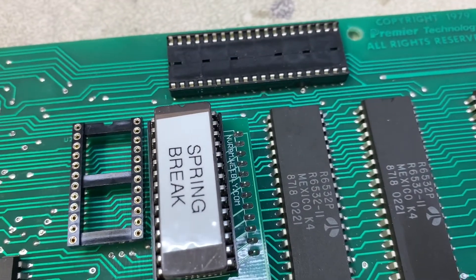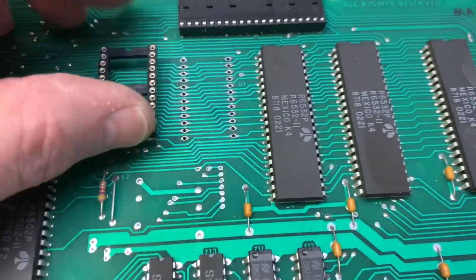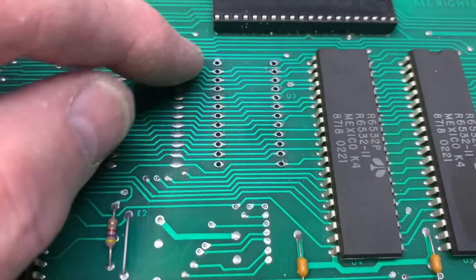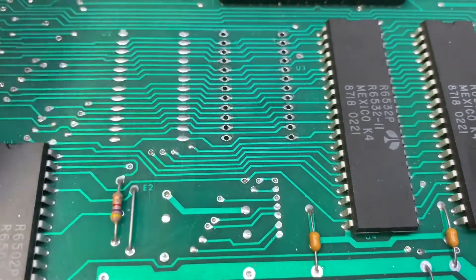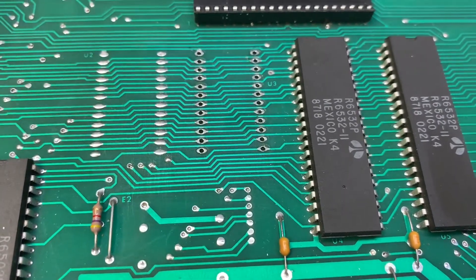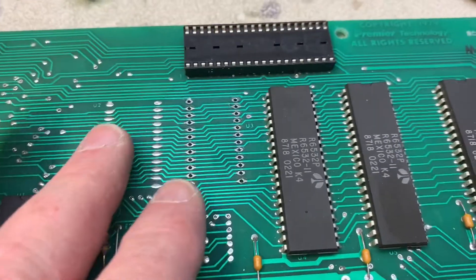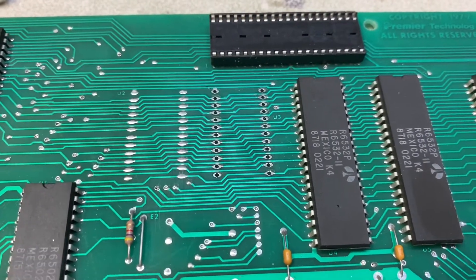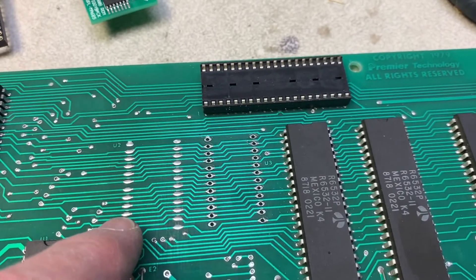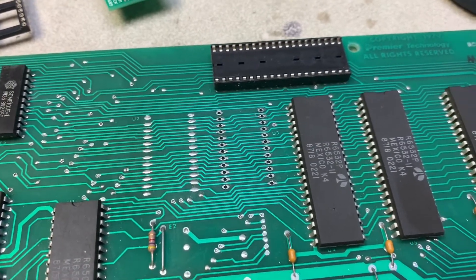In place of U3 will go a machine pin socket and a 2764 carrier — this one's made by nvram.weebly.com. I like this one when I've worked on the board and none of the chip pads or through-holes are damaged. If they are damaged, I'll clean the solder out of the U2 position and use one of the Great Plains Electronics double socket piggyback boards, which redundantly connects traces or solder pads from U2 to U3. I like that one when somebody else has already worked on the board or when it's otherwise necessary.